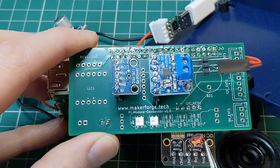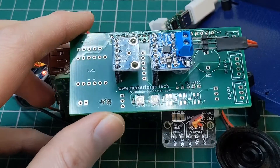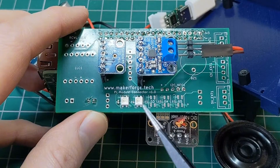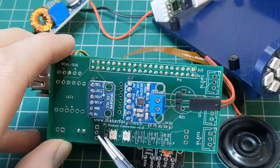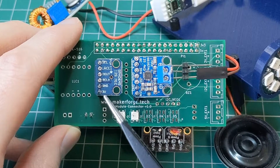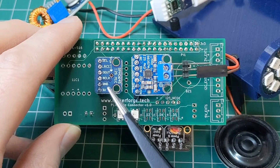These pins connect to this board, and what I've ended up doing is using female headers so I can disconnect these modules and actually reuse them on another board. Surprisingly the NeoPixels worked really well — as soon as I had these soldered in place I was able to connect it to the Raspberry Pi through the 40-pin header and get these to flash straight away, which was quite a surprise. Unfortunately that situation is not the case for either of the other two boards. Because it's a Raspberry Pi 5 or because it's the new Bookworm operating system, neither of these are compatible — at least the installation scripts from Adafruit do not work — so the microphone isn't recognized and it threw a few errors.